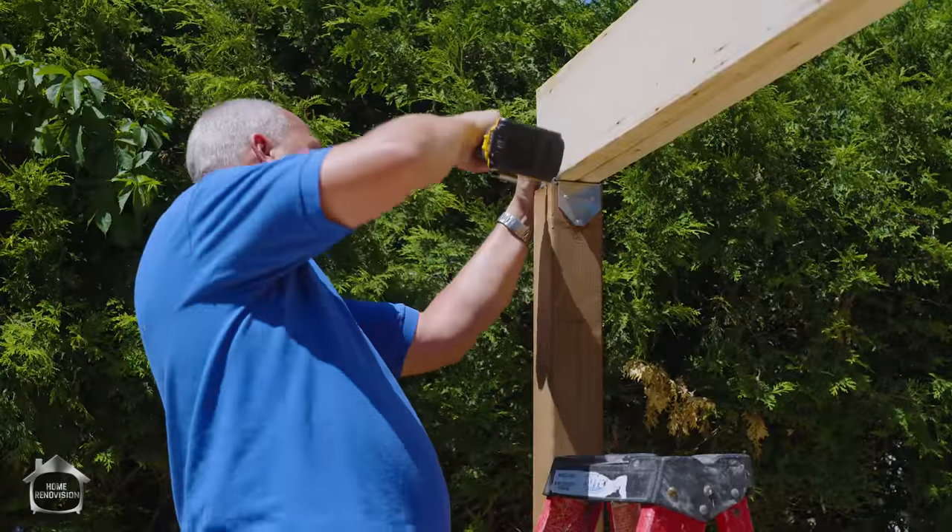I'm using an eight-foot 4x4 post in a deck block installed flush with the ground, so I know this is only eight feet tall from the grass. Plus my seven and a quarter — that's what a two-by-eight is. I'm well within my 10-foot limit even after I put my roof on. I want my finished panel on the front no more than eight feet so I don't have to add a seam, do waterproofing, and waste building materials.